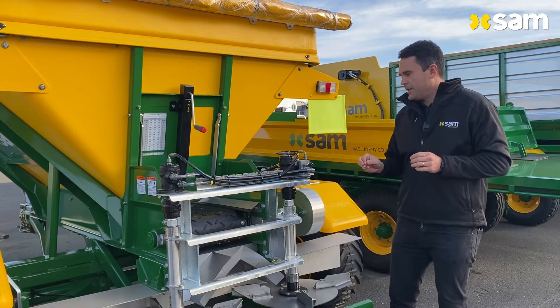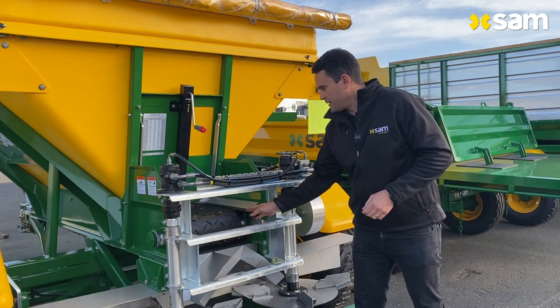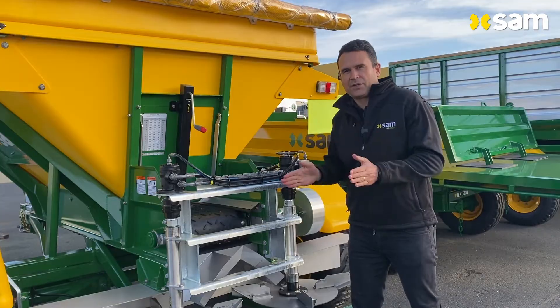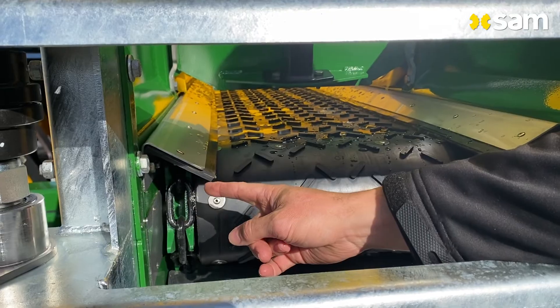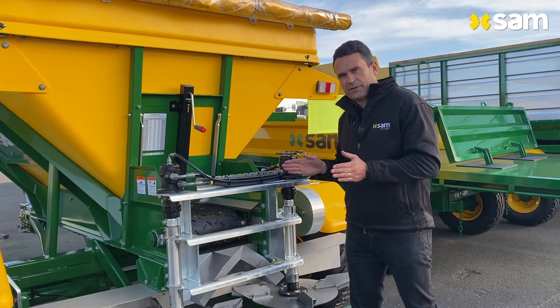The key to prevent that is making sure that the rubber on your side skirts are down flush on the rubber floor mat. You shouldn't see any daylight whatsoever when you look down the belt, and making sure that those rubbers are nice and flush.